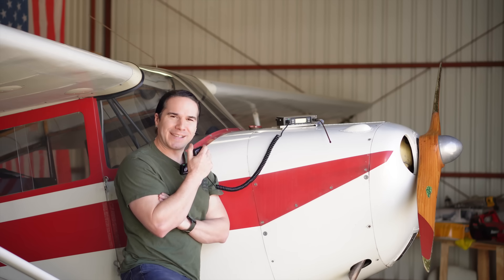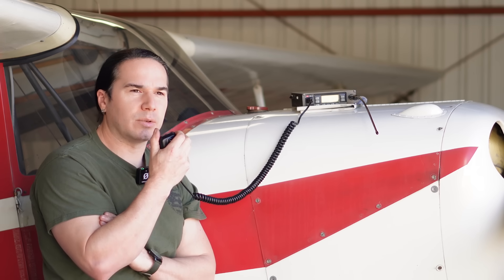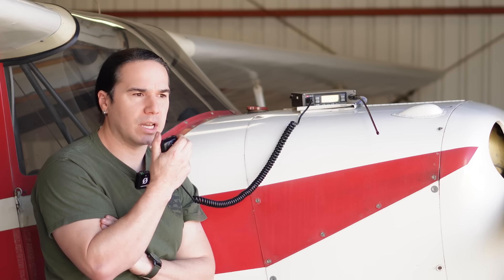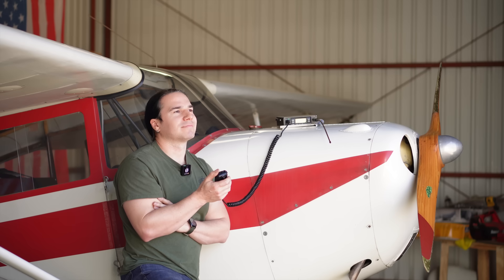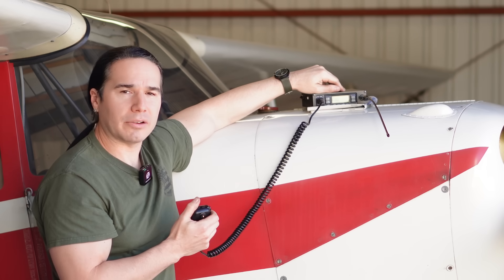It's a little bit low, but definitely copyable. Sounds maybe like an HT, but not bad. — Thanks very much. What this is, is one of these kind of man-pack radios — it's kind of like an HT that's been put in a box with a battery power supply. I'm just testing it out, first time I got the radio on the repeater. — I don't think you have any problems, so stick with it. — So that was great — pretty good report. Low audio, so I'll see if I can increase the mic gain, but I'm not talking super loud either.